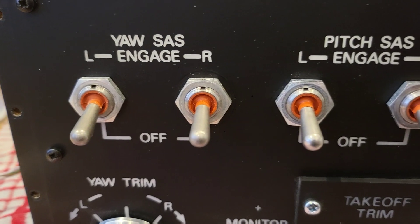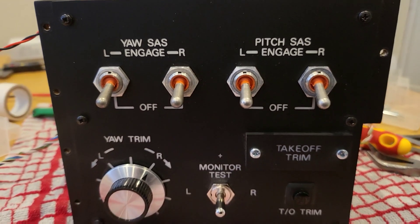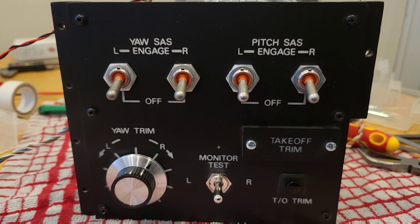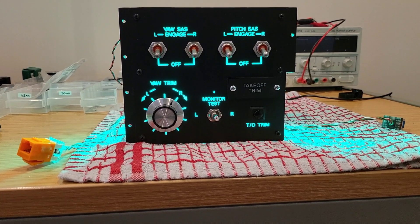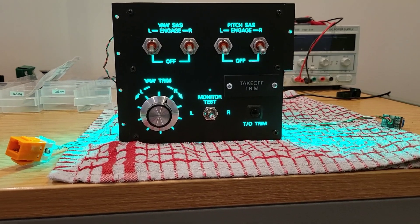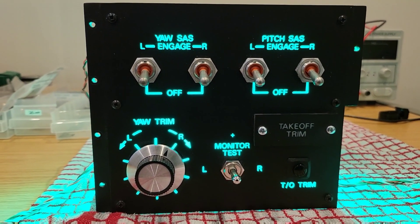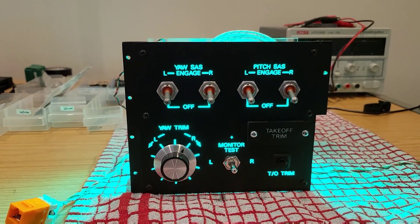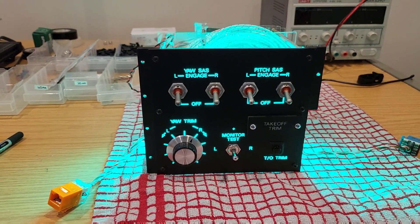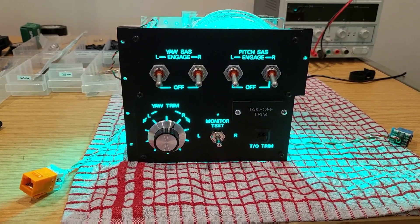So quite far into the build-up of the SAS panel now — they're nicely in place and I've tidied up the front a bit. Let's have a look at the backlighting. I don't use a light plate; the backlighting is on a standoff, set back. Sometimes you have to watch that big switches with large rears don't block the lighting, but in this case it's cascading through very nicely with a good even distribution.